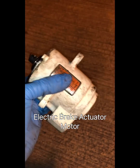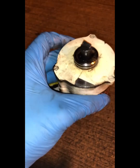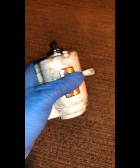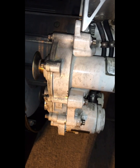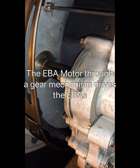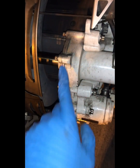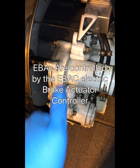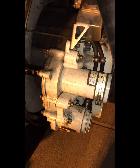This is an electrical brake actuator motor — just underneath the electrical brake actuator on the brake. This unit is the one that drives the electrical brake actuator. It's a motor that receives power from the brake actuator controller. After it gets power from the controller, it begins to spin, and when it spins it turns the gear mechanism, which then extends or retracts the electrical brake actuator. That's the operation in a nutshell.